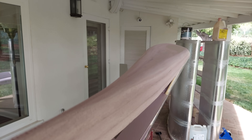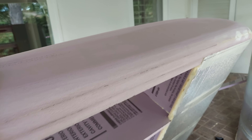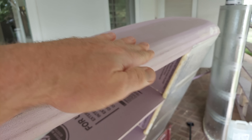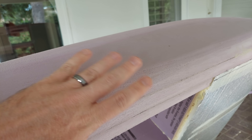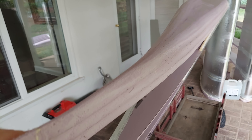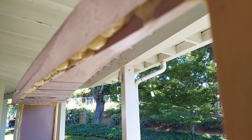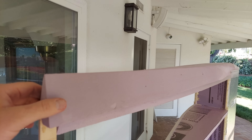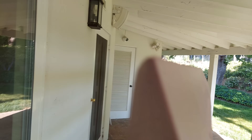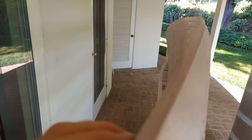So you can see this wingtip here — it's rounded, kind of like a typical general aviation airplane. Initially I was thinking this would deflect off the water quite well if you get a wing dip and it hits the water. But actually that's going to create a lot of drag and really dig into the water. So I'm going to redesign the whole wingtip. I just slapped on a flat panel — this is much more of a planing wingtip rather than a displacement wingtip like before when it was all rounded and aerodynamic. That's the basic idea.